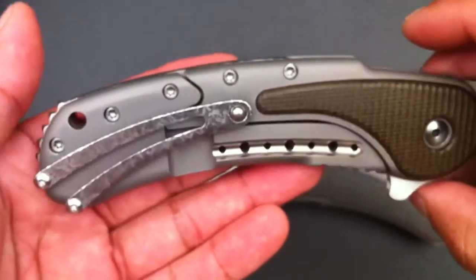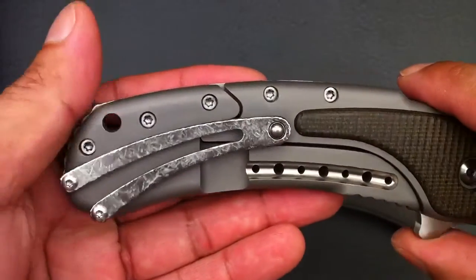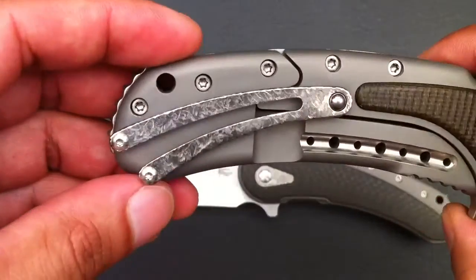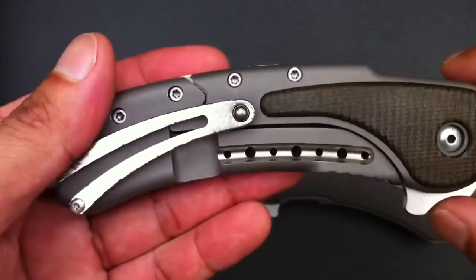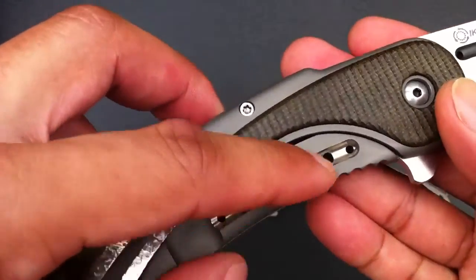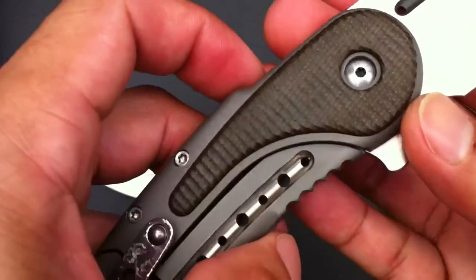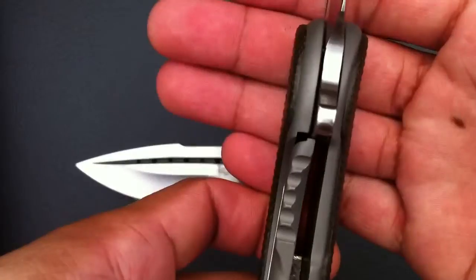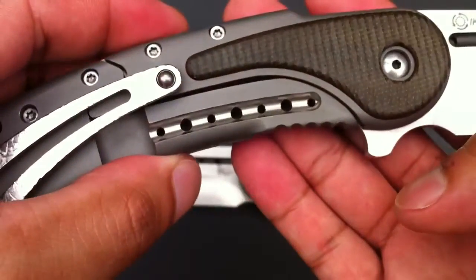The locking side of the handle — this is some pretty innovative stuff. It's actually two pieces: the front part and the back part which has the lock bar. Both pieces kind of work off the lock bar, and these holes have to be machined perfectly for it to function as intended. The lock bar has been milled out — it goes like a normal lock bar, but the upper corner of it has been milled out so it goes under the front part of the handle, which creates your over-travel mechanism. Pretty cool.